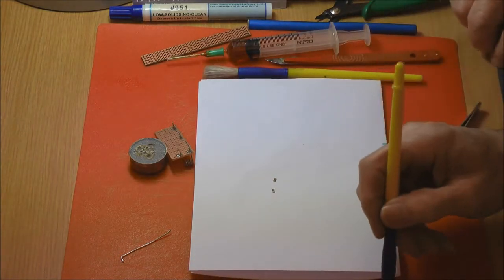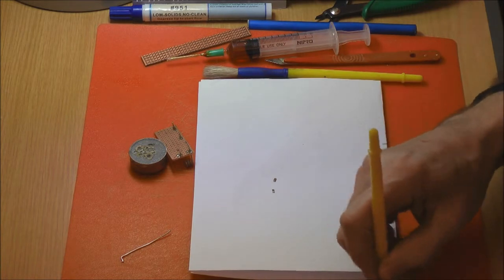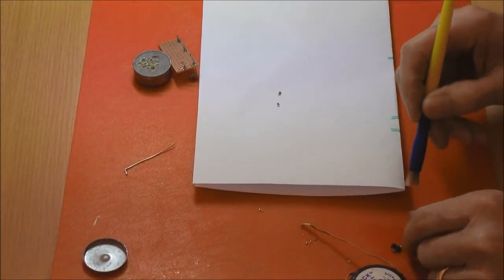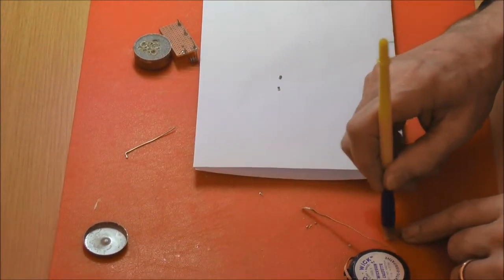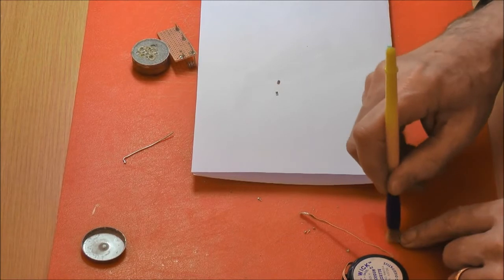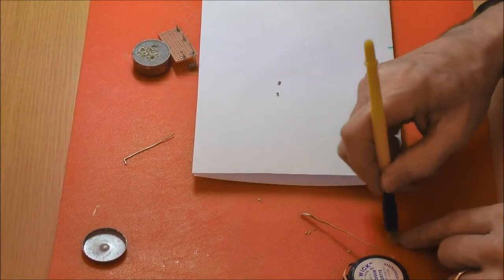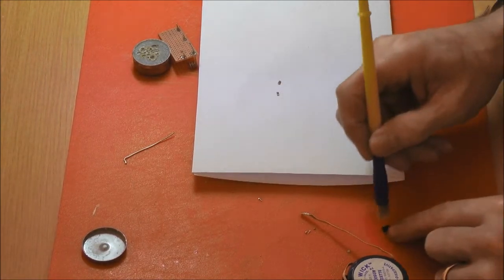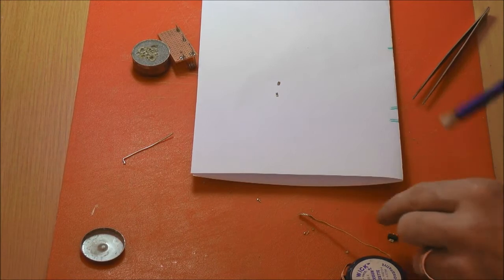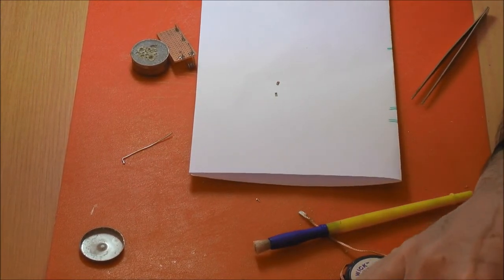A lot of these things you do actually work under a microscope. One of the jobs I used to do was something called a log amp, part of a piece of radar kit, and for 6 weeks I was doing repairs under a microscope, and the novelty wore off, I can tell you. As I say, with all things really, the important thing to get any kind of reliable joint is simply to clean it.